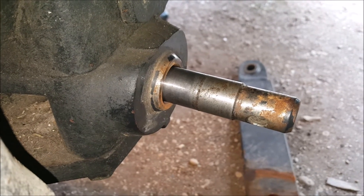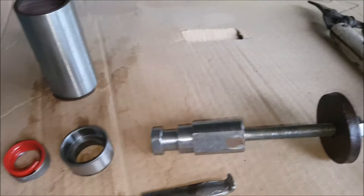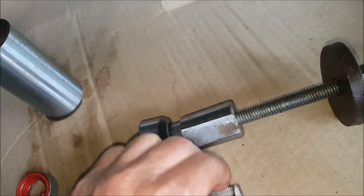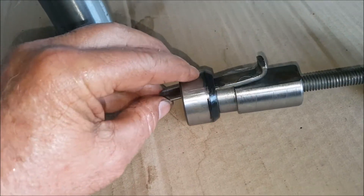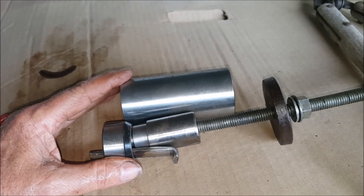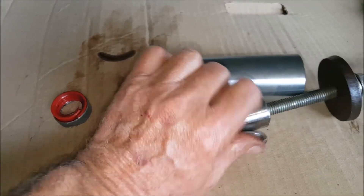I had to make a tool — I'll show you what that looks like now. Here's the tool I made. This one I've already got out. The tool goes inside this piece and when you get it inside there, it falls into place. You slide this keeper in like that and it holds it in where it's behind it and can't come out. Then I put the sleeve over the top of it, brought the washer back, made a puller out of it, and tightened that nut up on the end and pulled that piece out from the outside without having to tear the whole tractor apart.